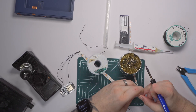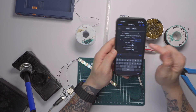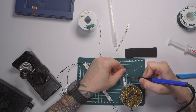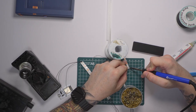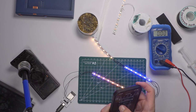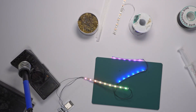If you'd like me to do a dedicated video on soldering and all the stuff I've learned, let me know in the comments below. As you can see, the LEDs are working — I've renamed it and I'm just using the WLED app to light up all the LEDs. Then cutting more wire and doing it exactly the same way: flux on the wire, big blob of solder, and soldering it all on. There are going to be three LED light strips: one for the bar and then two to go at the top and bottom of that resin PS2 logo. We've got all the strips working and I'm segmenting them so we can control each strip individually, even though they're all connected on a single line. It's just going to look amazing — flip it around and the PS2 logo lights up really nicely.